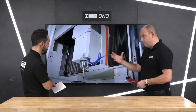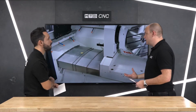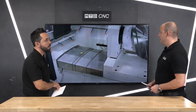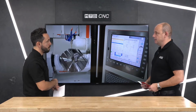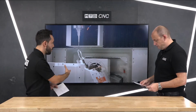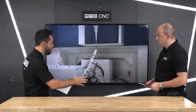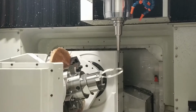But it's a full 5-axis simultaneous machining. I would applaud the access again to these machines, the way they're constructed, the way they're built for various applications in all industries with the Heidenhain controls. So Heidenhain controls, you mentioned kinematics. This is extremely important, and it means that you can present the component anywhere on the machine bed, and it will be able to figure out the datum points.